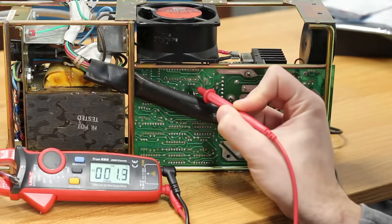While I've got the soldering iron hot, I'm going to go ahead and repopulate the entire power supply. In the previous episode we removed the control transistor, driver transistor, and pass transistor trying to figure out what was causing the weird overvoltage. Those components may still be good, but since they've already been removed it doesn't make sense to put old components back in when I've got brand new parts sitting right here. For the 12-volt rail I replaced the 7812 control transistor, driver transistor, and pass transistor. For the 5-volt rail I replaced just the driver transistor and pass transistor. With everything repopulated, I'll swap in a new 7915 negative voltage regulator.